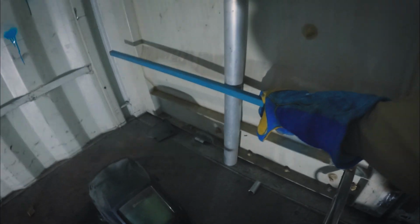So these 2 doors, this one closed properly, so I've tacked these in. I know they're not the prettiest of welds, but they'll do for their purpose. But this door was bent out, so it wasn't quite closing properly. It wasn't going to be flush here for when we build the wall on it. So I've made up this little bracket here, got this bit through here, and levered it so that now we have these 2 surfaces flush.